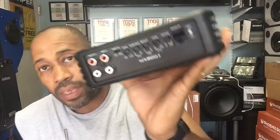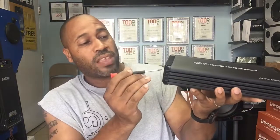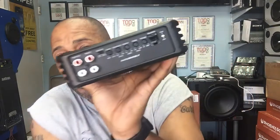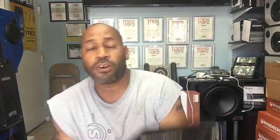Now the problem is, on most amplifiers like the Phoenix Gold amplifiers, you have the crossover setting, which is here. The knob says 50 to 250, so once you turn the knob, you're not sure what frequency you're at. It could be 51, 57, 86, 92 — you can get close, but there's no way to know exactly what frequency you're at. So that's where the crossover calculator comes in.